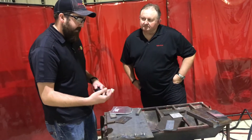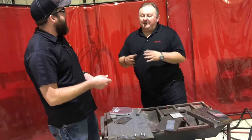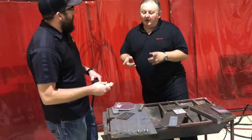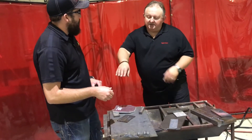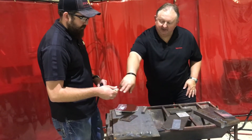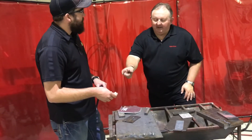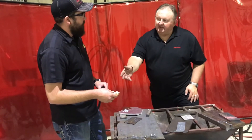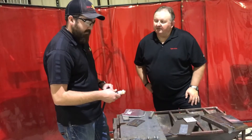When these are sold, do you buy them individually or as a kit? Originally you have to buy them all as a kit because you have to have all five pieces. The pieces that will wear out on a regular basis and that you would replace more frequently are the nozzle shield combination, because this is what's doing most of your cutting and getting most of the damage, and then the electrode inside. Those are the two typical pieces that wear out. All the other parts will wear out in time but typically they don't unless you damage them yourself.